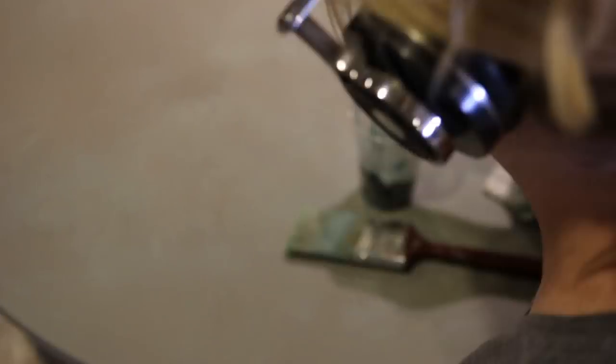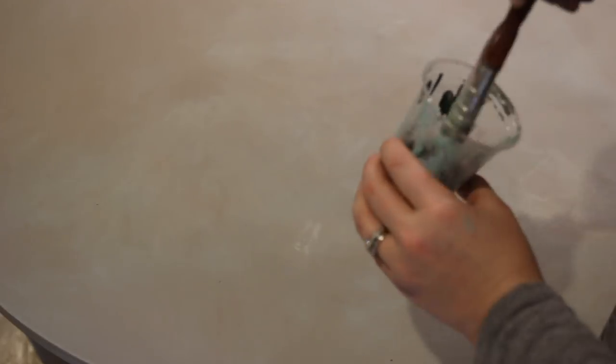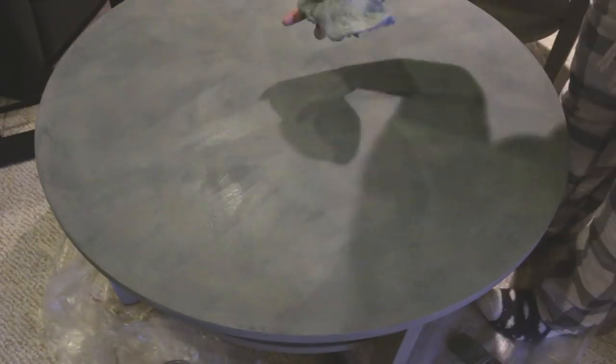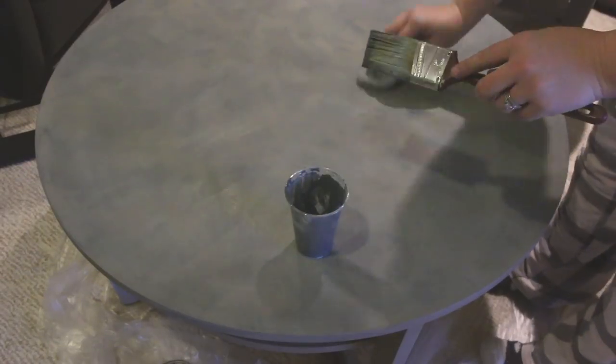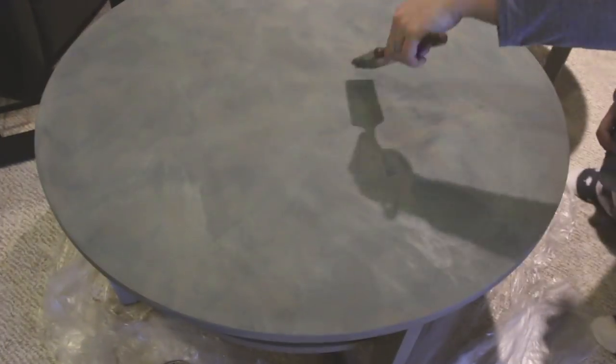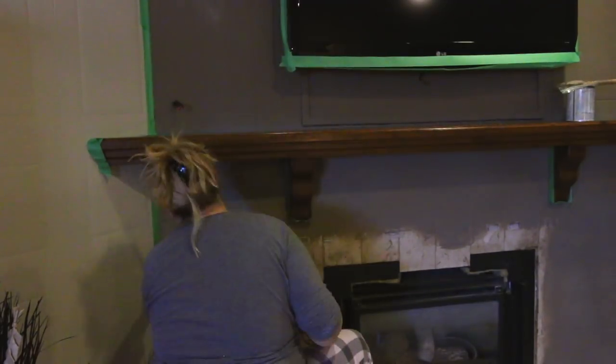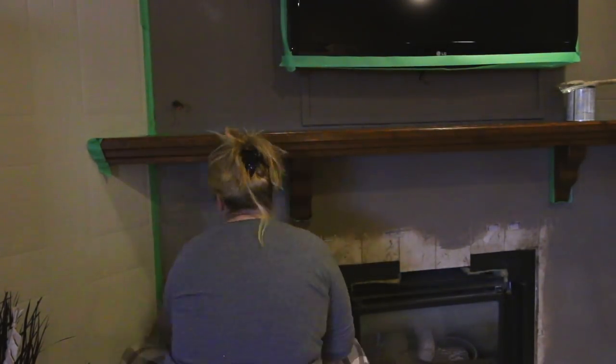Now I'm going ahead with a darker color, mixing it half and half with water. I'm going to put all the colors down below, and I'm dry brushing this on — removing most of the paint and then just dry brushing it so you can really catch those brush marks from the original coat. I covered the whole table in two different darker colors over top, a gray and a dark blue after whitewashing it. I liked it so much I did the same technique over top of the fireplace using a dry brushing technique.